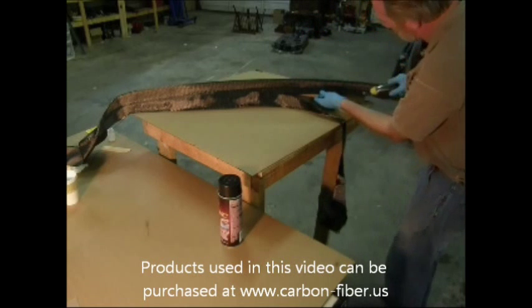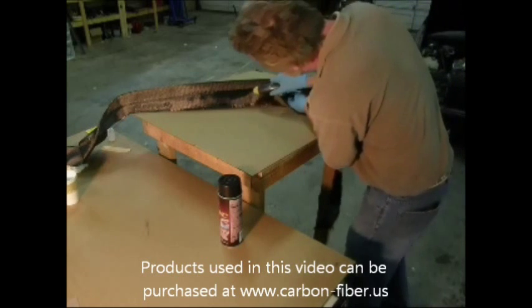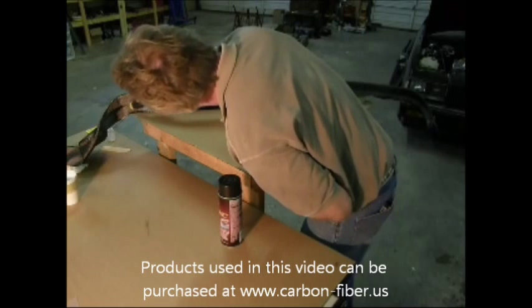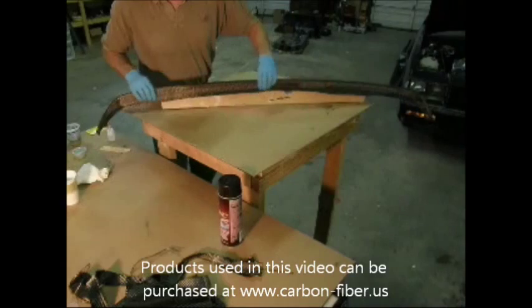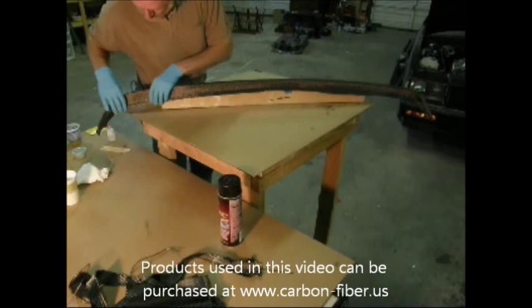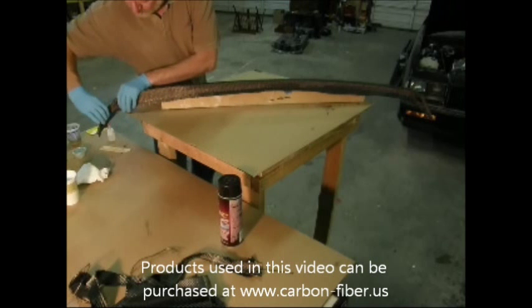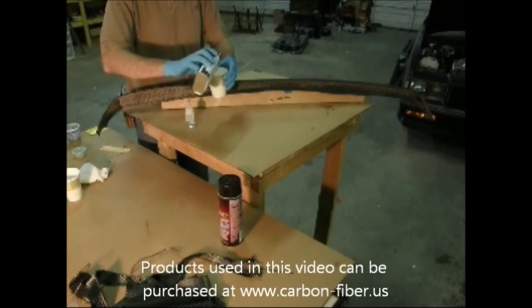Try to get as close to the bottom edge as you can — that's the only way you can visually check and make sure that you have a nice tight lamination. Once you get all your excess trimmed off, just give it one last press along the bottom edges and make sure it's all adhered well.